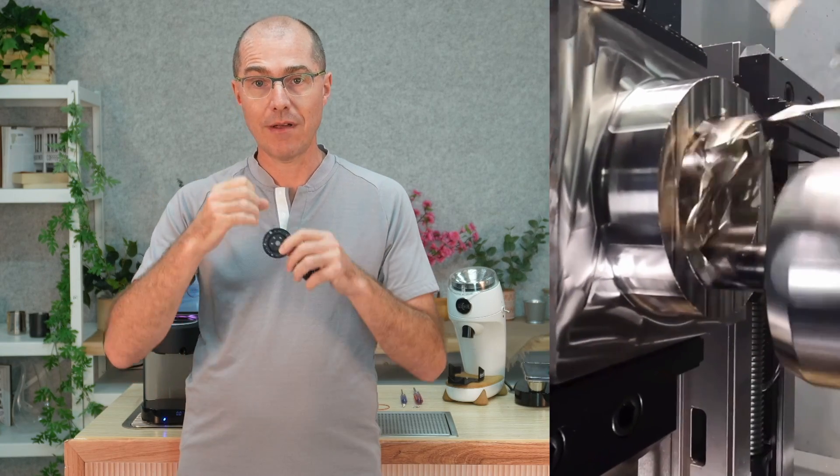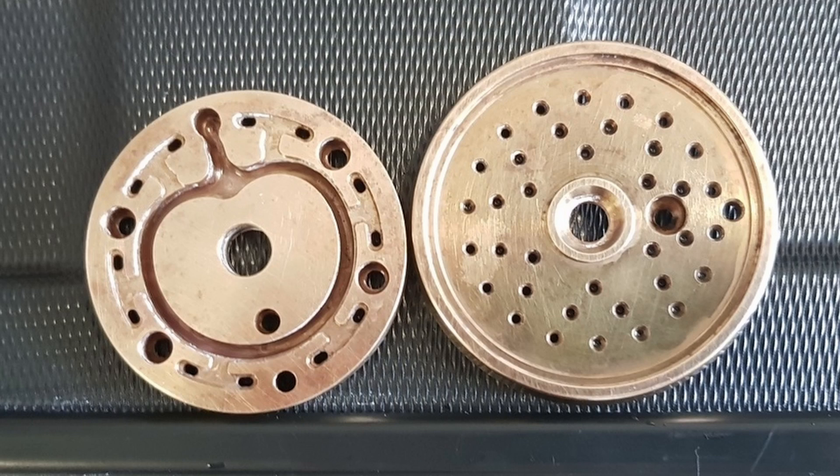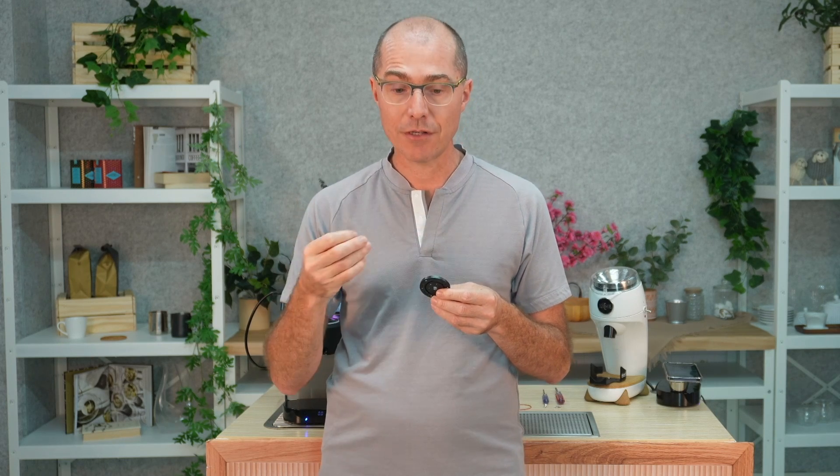Back in 1970, no one really worried about lead, but it's an issue. When you try to use CNC — computer-controlled drilling of these parts — a lead-free part is very hard to tool to round, and that means your CNC costs are much higher. We have been making CNC'd brass versions of these parts for the past seven years. They've been quite expensive and required fairly frequent cleaning because of zinc leaching and tarnishing. It also turns out that coffee oils tend to stick quite a lot to brass.